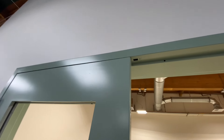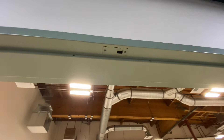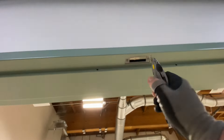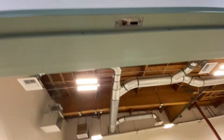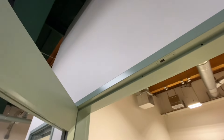I'm noticing the strike plate in the head of the frame is backwards - that's a pretty common thing. It's a reversible strike plate in the head of these frames. You can switch it to either side, super convenient. The sheetrockers did their thing and tucked sheetrock down into the frame, so I just want to make sure that sheetrock isn't going to block the flush bolt from going up in there. I clear a little bit out of the way, flip that reversible strike plate around, and now it's on the right side.